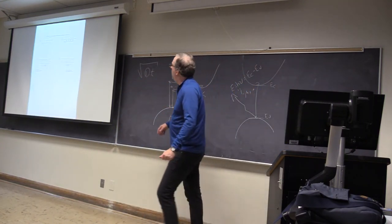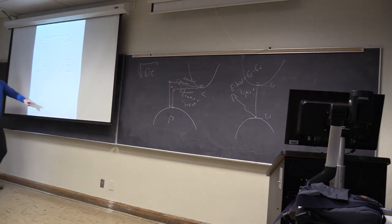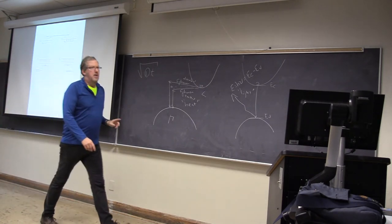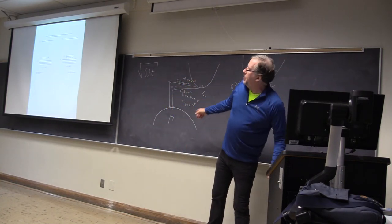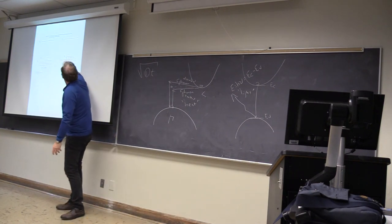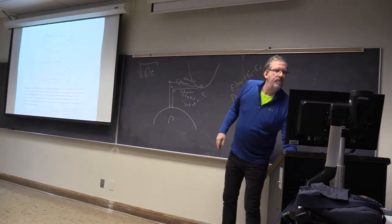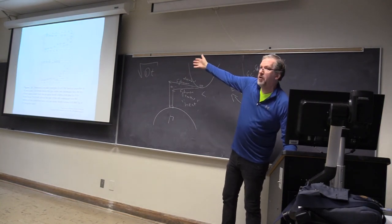And so here's the donors. So at 0 Kelvin, they're frozen. And at a finite temperature, they've released their electrons. And here's the acceptors. Acceptors accept electrons, right, because of the name. So they accept electrons, creating the holes as a consequence. We can put all these different dopants in. Some are preferred, some are not.